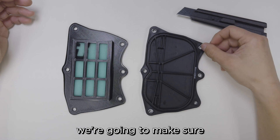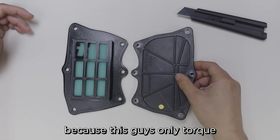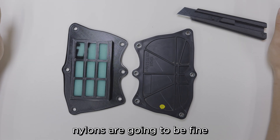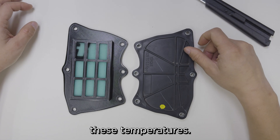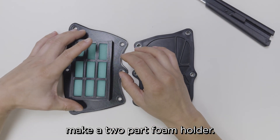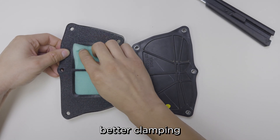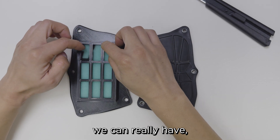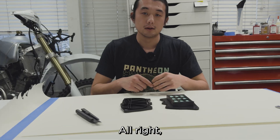On our design, we're going to make sure we include the O-ring groove. We'll probably skip the steel inserts because this is only torqued to 2.5 Nm, which carbon-reinforced nylons are going to be fine handling at these temperatures. And lastly, I think we're going to make a two-part foam holder. It's slick that the original is one piece, but I just want better clamping to keep the foam in place. With a two-part design, we can have a nice sealing strip around the edge that'll compress it more.